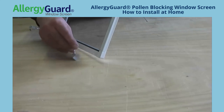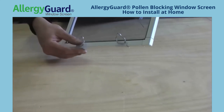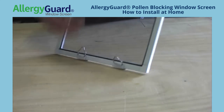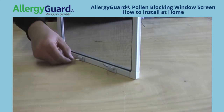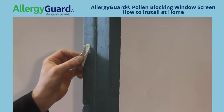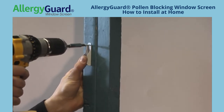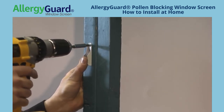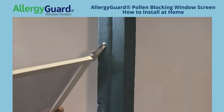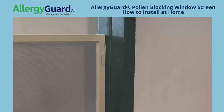One of the easiest hardwares to install are slip-on loop latches. All you need to do is slip them on your screen frame where you would like them placed. These loop latches then fit over a screw that will screw into your window sill. The top portion of a spline-in or slip-on loop latch is called a friction hanger. It can be screwed into the side of your window sill. Then rotate your friction hanger outward, slide in your screen, and rotate your friction hanger vertical once again.